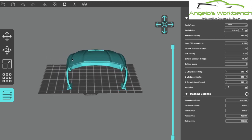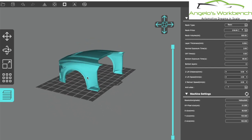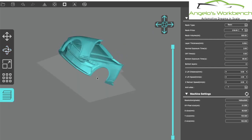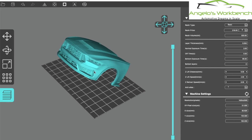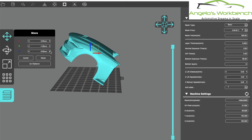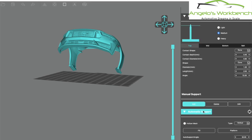You take the file and put it into your 3D printing software - this is called a slicing program. You'll see I was moving that front end around because the body has to be within the print area. I'm printing it at an angle so that it prints better - if you have a wide flat surface you run the risk of a failed print. The tip was dark gray, meaning it would have been outside the print area, so I moved it up five millimeters off the build plate to give enough room for what's called the raft and all the supports.